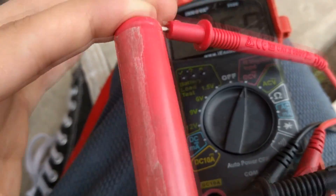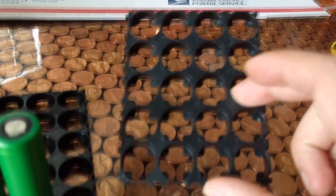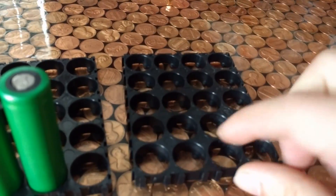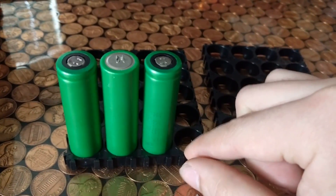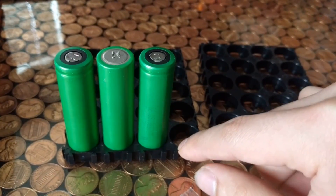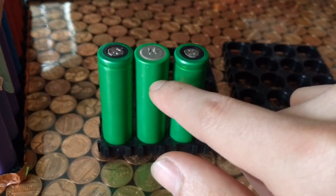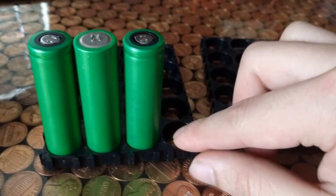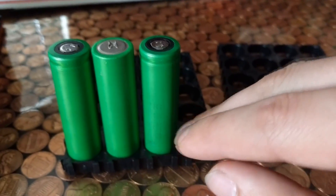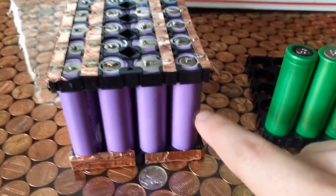After testing the batteries and making sure they're charged, you need these 18650 cell battery holders. The way I configured mine is four cells wired in series, so you get 3.7 volts from each — 3.7, 3.7, 3.7, and another 3.7 — which ends up being about 14.8 volts. Then you can step it down using a controller and use a 12-volt inverter.